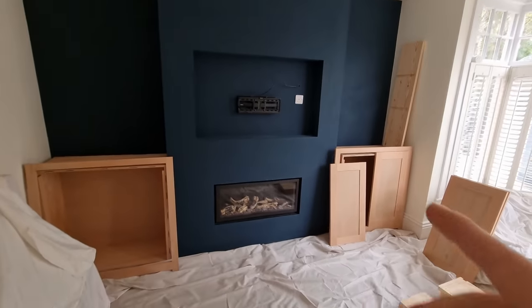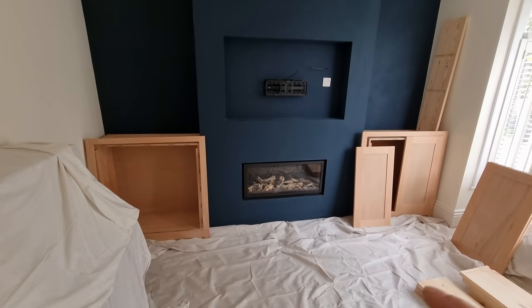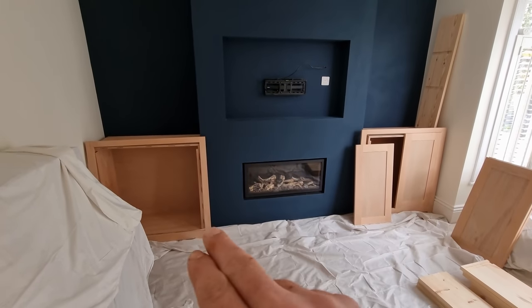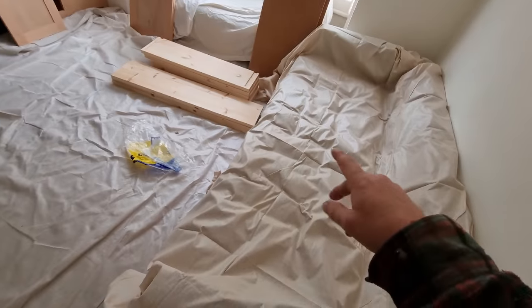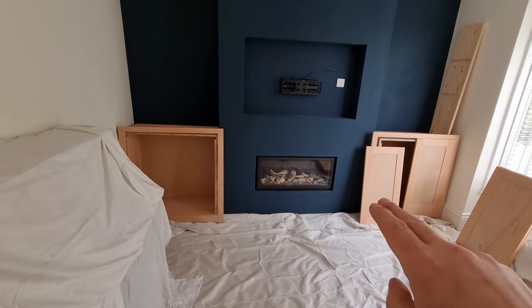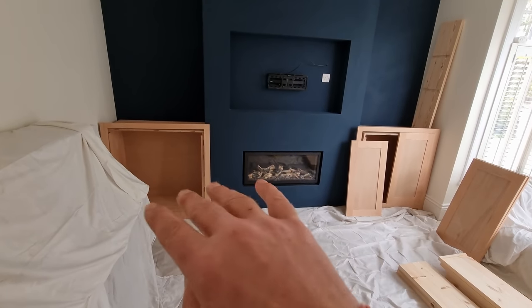I need to get these cupboards out, get a 2x2 base on the floor. I want to get these tops level. So I'll get me laser out, stack it on here somewhere, and then work from my highest point, wherever that is. Then I can pack the rest up to that point.